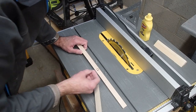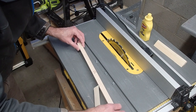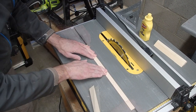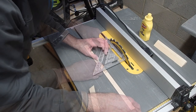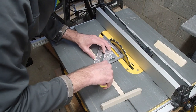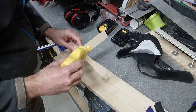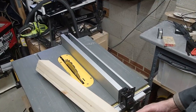While the glue is drying, I'm going to make this jig. I'm taking a couple of M5 nuts and putting them in the trench of the t-track and placing it just above the t-track. I take a speed square and line it up, then take the 45-degree cut I just made, put a bit of glue to set it, and let it dry. For a little bit of extra support, I put a bit of glue, add a piece of wood, and clamp it down.